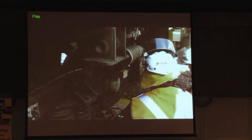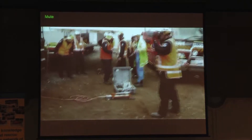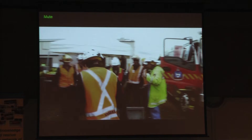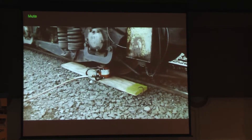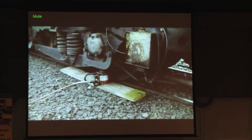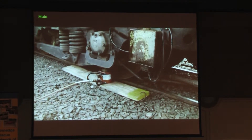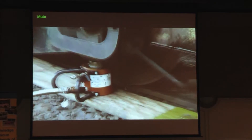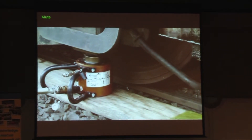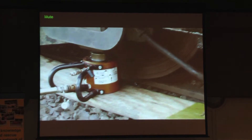At the end of the training, we had a go at lifting a loco, very similar to the one that they had the incident with. One of the things that we recommend — the best thing we have found for operating these 20, 25, 30-tonne, and 50-tonne rams — is an air-operated hydraulic pump, an air turbo pump. You get fantastic control in both the extension of the ram and the release of the ram. Those who are prepared to put their hand up and jump in and operate the tools will get to see how good these devices are. We'll be using both hand pumps and air-operated hydraulic pumps down at the rail yard today.